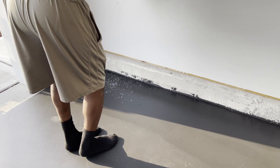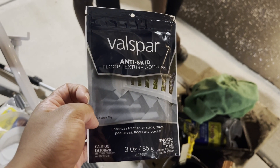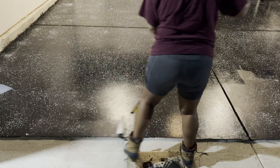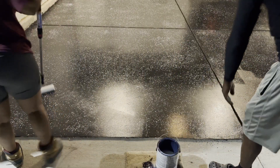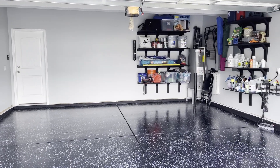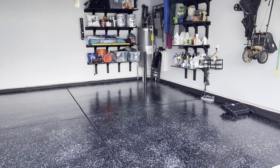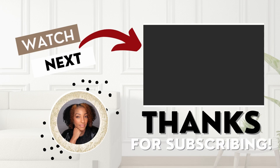Here is a closer look of him throwing the flakes down after I have painted the floor — you can just see them falling wherever they land. He's throwing them from up high, so this gives you a better idea of how to do this process. We also added anti-skid into our coating, and this is pretty much your final stage — the coating seals everything and pulls it all together. We did two or three layers of coating once everything was dry, and then the next day I added black to the top portion of the garage to pull it all together. And this is the outcome — please go ahead and watch our next playlist!